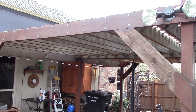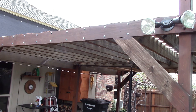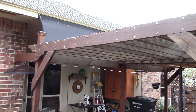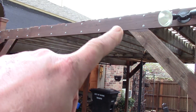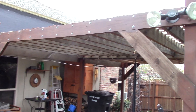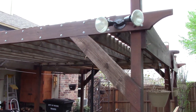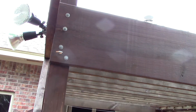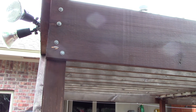Hey, Chris here in Oklahoma. I went into operation strengthening pergola slash solar panel stand. Got all lag bolts in here now — used three inch and four inch on some of them to strengthen this thing up. And this 2x12 here, used the big honking ones.